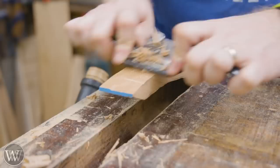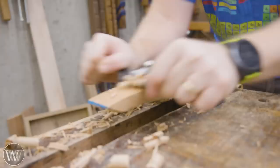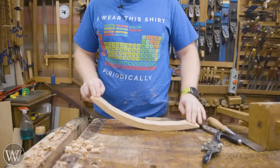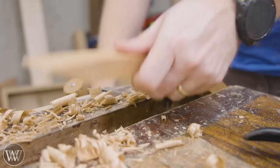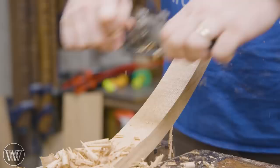I'm going to get it really close to the shape with a spoke shave, and this is very quick. I'm going to be doing all of this with my Stanley 51. It's a nice plane that runs really well, especially on the outside. On the inside, I'm going to extend the iron out a little bit because it's going to run on the nose and heel of the spoke, and that makes it so I can do an inside curve. If you rock it back and forth on the bench, you can feel where the bumps are. On the outside, I'm starting at the top of the arch and going towards the points. On the inside, I start at the points and then go towards the middle. You have to be a little more careful right when you get to that top point so you don't run past and go into the grain on the other side.